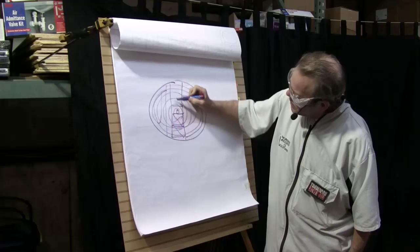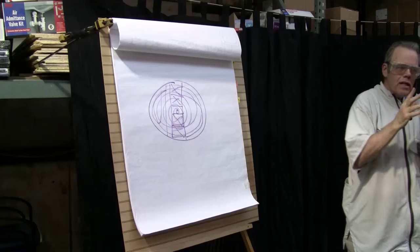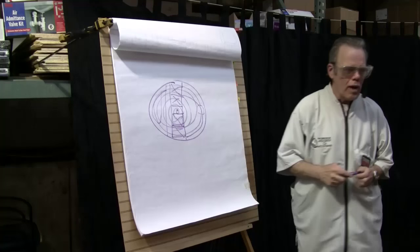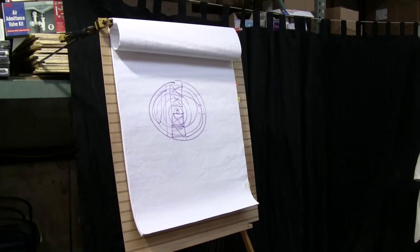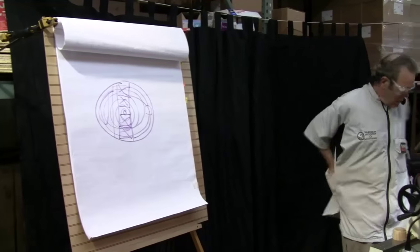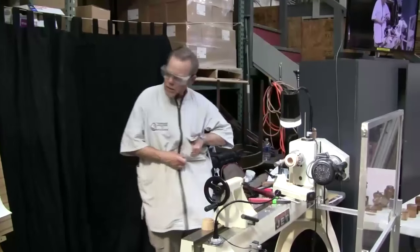spindle blanks. And it's all quarter sawn wood, which is perfect because it's not going to move as much. You get a box blank out here, and it's going to be a little more problematic. So this is a perfect way to use this, and then you throw away this part in the middle. So that's where you get your wood from. And you just get in the habit of, when you break down your bowl blanks, putting that spindle stock up on the shelf, and then you're going to be good to go one of these days when you start making boxes or something else.